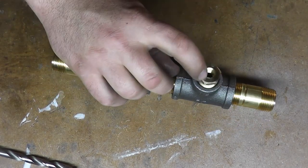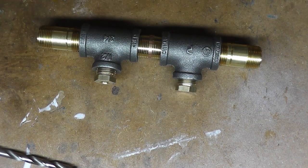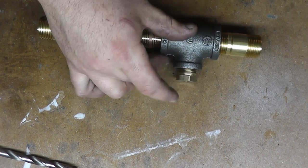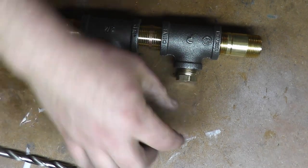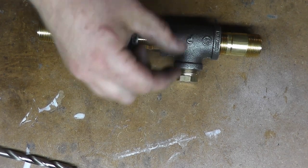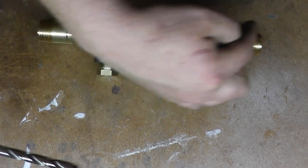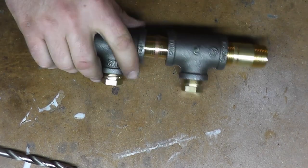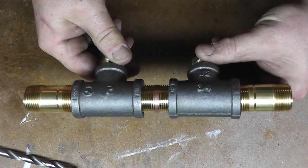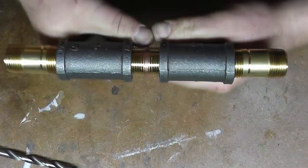so we can screw it right into one of these holes. This other hole, all that's gonna hold is a metal rod, probably just a regular steel rod, because I got a bunch of 3/8 steel here. A long 3/8 steel rod, and at the end of that rod will just be a brass tip. And that'll be threaded probably just at the end, maybe about a quarter to a half inch of thread, but that is going to reach all the way down into that half inch pipe. So that's going to be our locking mechanism, because this is never going to sit perfectly vertical. I'm going to want to swing it to the side or to this side. So we need some way to be able to lock this at whatever angle we need.